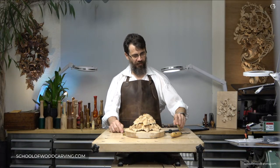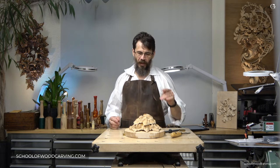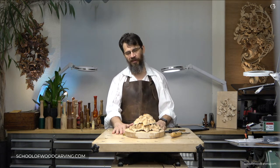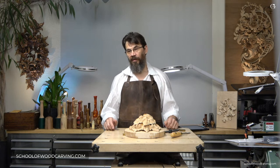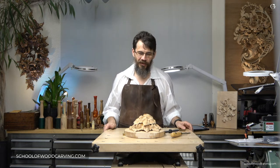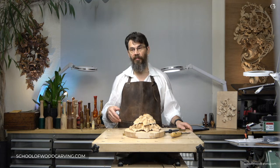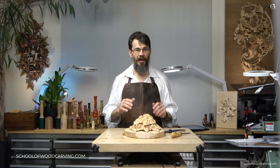But let me get back to the question. The question is, we all know wood is an excellent material. I love how it smells. I love the grain, but it has a weakness for at least about 10-15 years. When you buy a brand new piece of lumber or timber, if you're in England, it could be dry, it could be kiln dry, but the fibers themselves are still fresh. They are not dead. They're not stabilized yet.